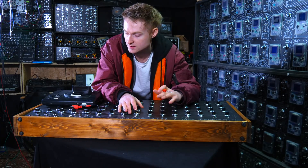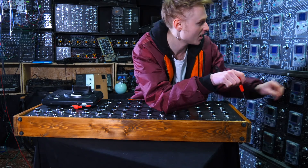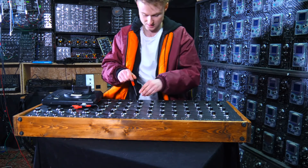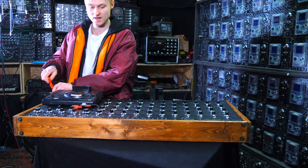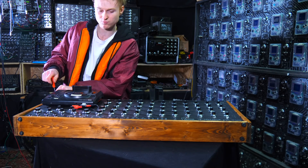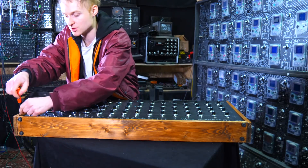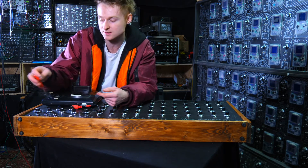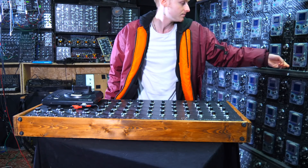Like I mentioned in the other video, this is basically a glorified MIDI controller that's been custom built with the interface of the FM synth inside the Sega Mega Drive in mind. You could assign all of these to something like a Behringer knob bank, but there are a few annoying quirks I had to adjust - for instance, to change the algorithms I had to make sure it wouldn't go back to CC zero and would only send one CC command.